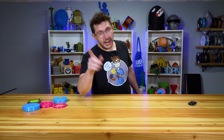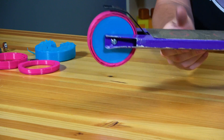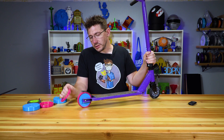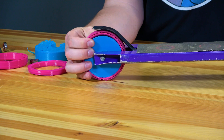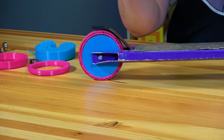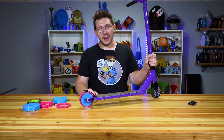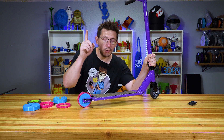David did a fantastic job, and this performed better than I could have imagined. Look at how broken the tire is — that is crazy, but the wheel itself survived. The tire stretched out a little bit; I think a flexible material might not be the best choice. Maybe I need to adhere it or just use less of it. But the wheel itself — at 50% infill, five top and bottom layers, seven perimeters — held on great. You could tell at the skate park it was going. It was a little bit slow, but we had a lot of fun. We tested and verified that yes, you can 3D print your own scooter wheels, but it may not be as fast and may not stand the test of time. Big thanks for everybody that watched — don't forget to subscribe, don't forget to hug each other more. I love you guys. High five.